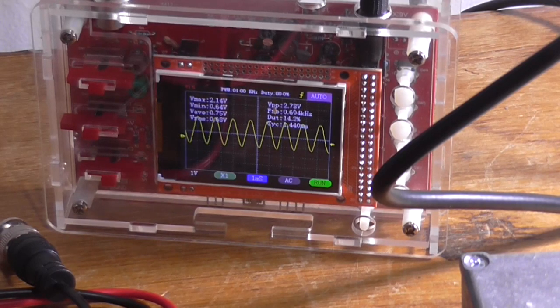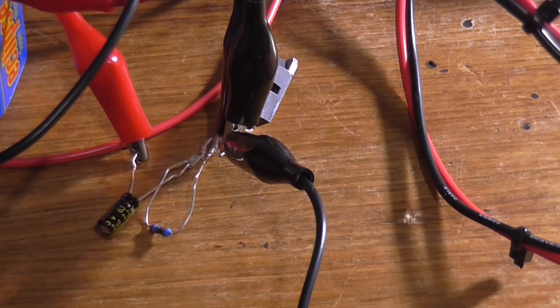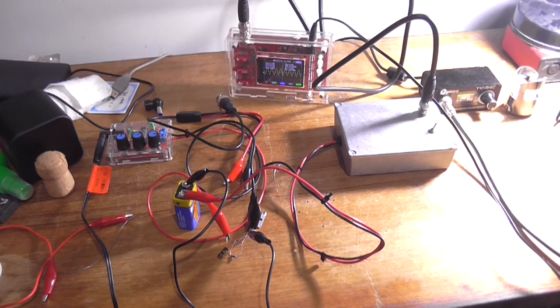I'm kind of not surprised. So this little concoction, whatever the hell you want to call it, is not really worth the time or effort building — unless you want to destroy your loudspeaker of course. I'm only running mine on 9 volts, or close to 8 volts. Yeah, it's not looking good. That is a complete waste of time; I wouldn't bother with it. Please guys, stop making these videos unless you have a basic understanding of how the circuit actually works, because you can actually cause a lot of problems for a lot of people by destroying stuff — like loudspeakers. Just saying.